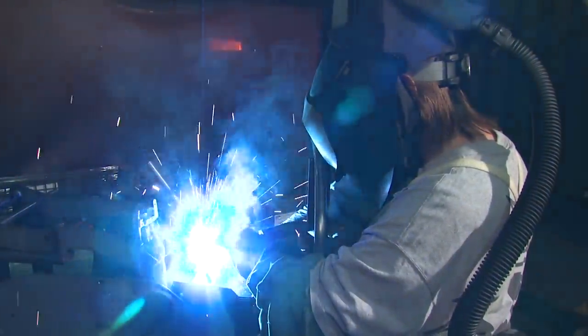We start in the fabrication area. We do a process capability on all new parts as they're released into production to make sure that the process, the people, and the equipment are capable of meeting the print requirements from engineering. We follow that through weld with the same capability studies. Paint, we have performance standards, metrics, comparison boards, go, no-go type comparisons that we use.